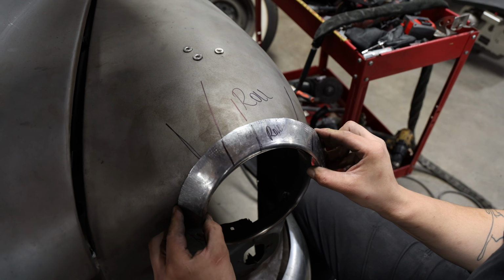If you've noticed, Phil's welding weapon of choice has been a TIG gun, but on parts of the lower edge, he'll be using a MIG instead. There are two reasons for that. First, on the top and inner edges of the headlight surround, he had access to hammer out his welds. This is a crucial step when using a TIG welder to butt weld two pieces of metal together.